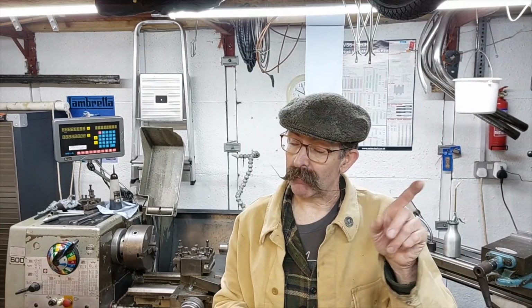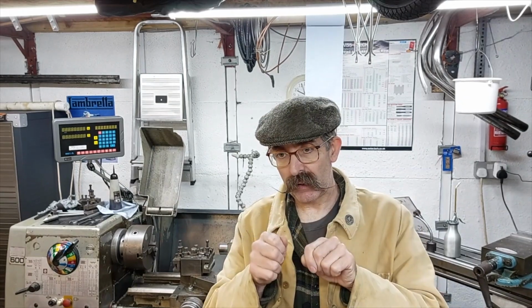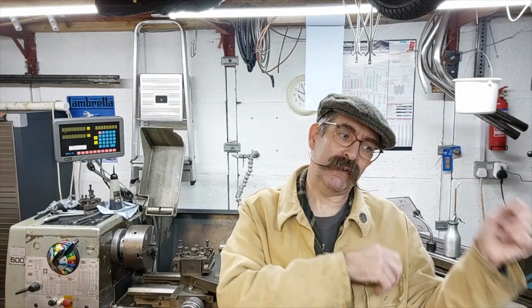That's my excuse anyway. And it's sort of kicked up. I'll show you where it's kicked up at the very end. There's sort of like a 7-inch lead in. And it's amazing how the angle iron is distorted. Even though I was really careful, I went round and I tacked everything, tacked the webs, and then went and tacked the webs on the other side, and then went to the other one and just gently worked my way round.